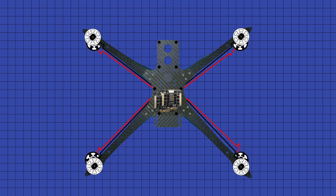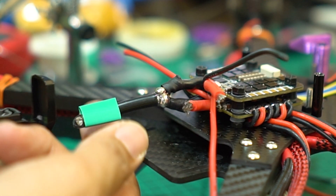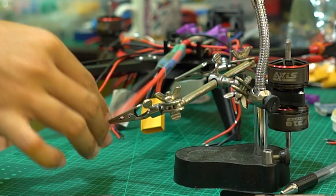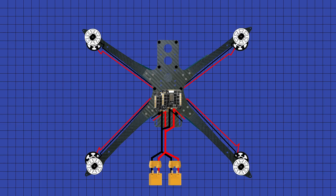For the positive terminal, I put a 12 gauge wire — which is a thicker one — facing the back, while an 18 gauge wire faces to the side a little bit. Same gauge wires for the negative biasing towards the same side. Both ESCs' larger wire would meet a 10 gauge wire, which splits to another set of 12 gauge wires to streamline to two XT90s. I wanted to leave it open for me to be connecting two smaller LiPos in parallel in the future. But if your build intends to use only one battery and you're very sure of that, you can have both ESCs' 12 gauge wire meet a 10 gauge wire and straightaway connect it to an XT90.